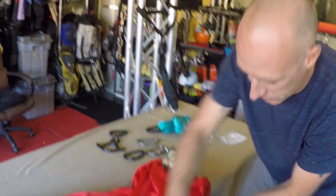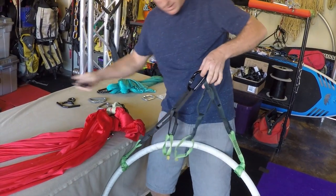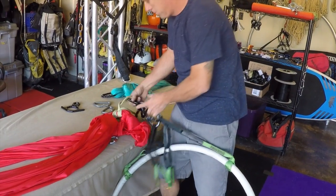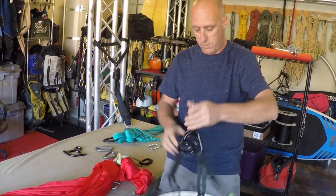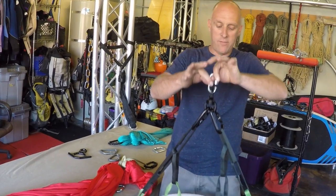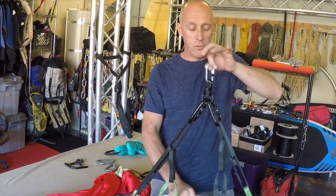Take a look at the hoop — same thing. Two carabiners, each coming into their own swivel — we'll flip these and lock them. That's an appropriate use of a carabiner for a three-way load. Now there are other ways to rig this — I'm just using this as a demonstration. There are a hundred ways to rig these things, however a whole lot of them are mistakes people are getting away with, and sometimes not getting away with.